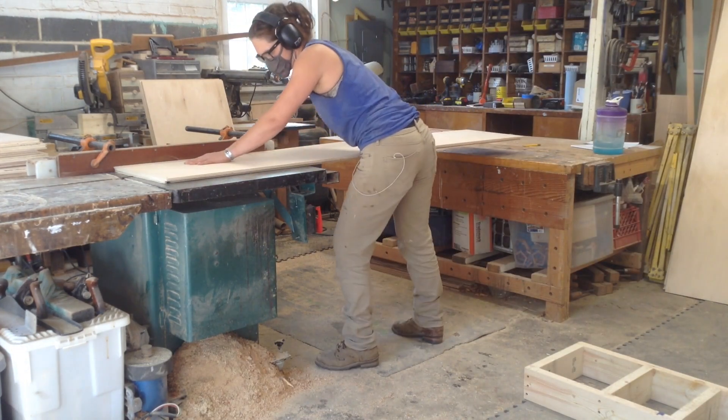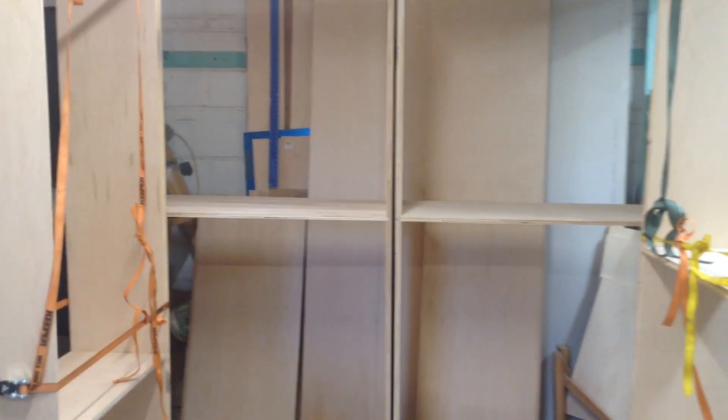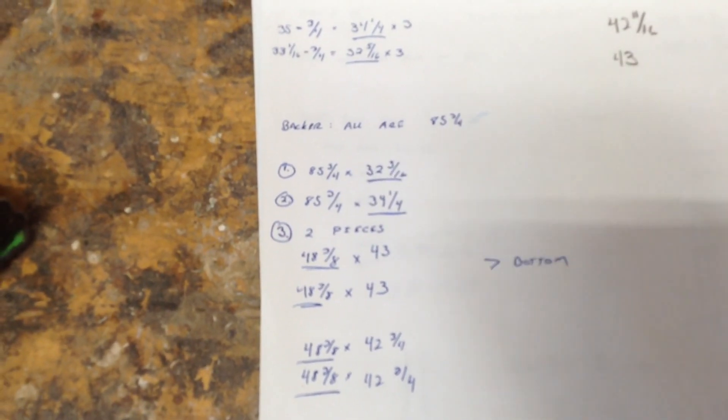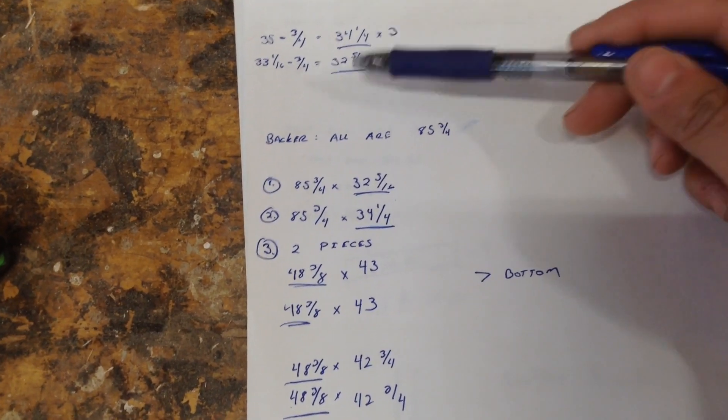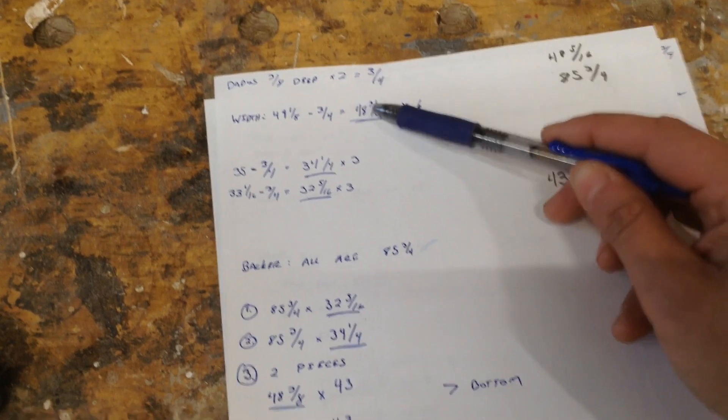This is a lot of cutting: cutting down all your pieces, adding all your cuts for your shelves, adding a rabbet for the back, adding a rabbet for the front — before you even put anything together. But I find it a superior way to make cabinetry and the steps going forward are easier because it really squares up all your frames. Looking at the back, you can see how everything lines up with all my marks on the base. If you're new at this, there's no shame in drawing stuff like that out on your base — I'm a visual person. An off-cut on pieces of plywood this big can mean having to buy four new sheets at about $80 a pop.